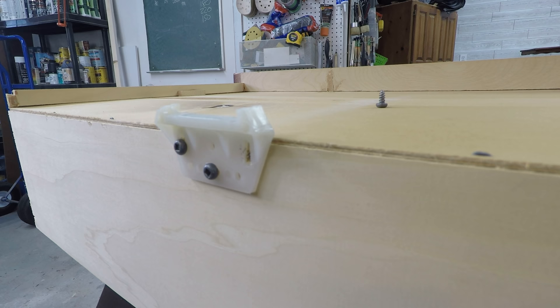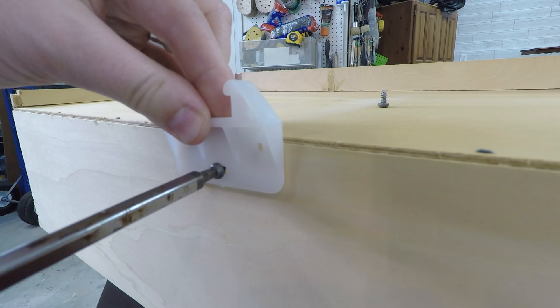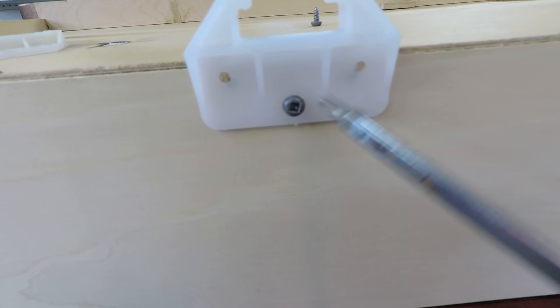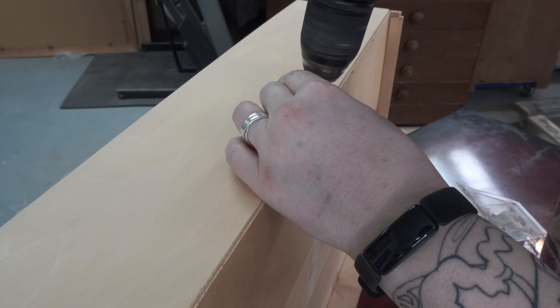And there it is — I always find a plastic drawer piece that's broken in every single dresser, always at least one. Luckily I keep these on hand, and I'm just going to do this right away so it's done and I won't forget about it. It's a different shape than the other one, but as long as the height is right and the width is good, I'm going to give it a little test before I fully install it. Looks good. I'm going to go ahead and drill some holes because the holes on the new piece are slightly off from the old one, then put the screws in and away we go.